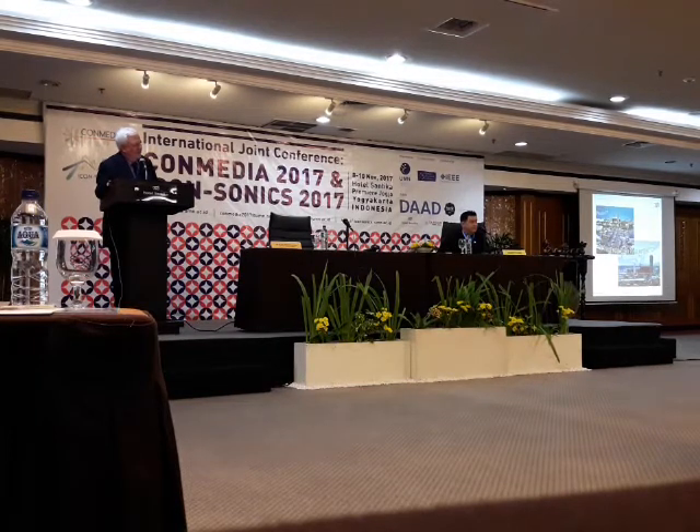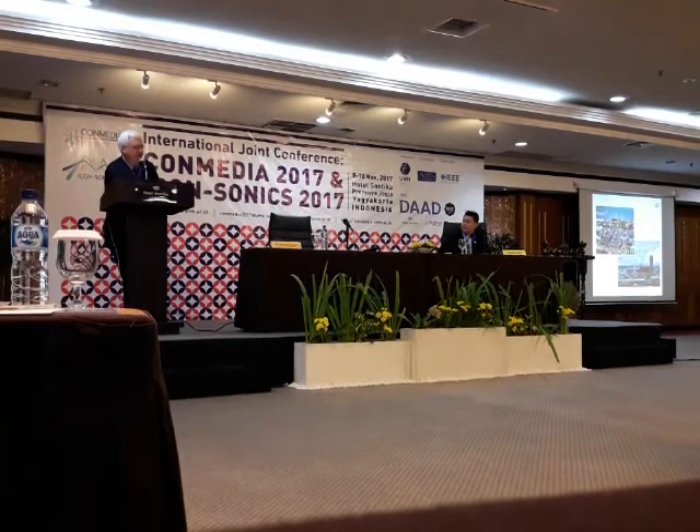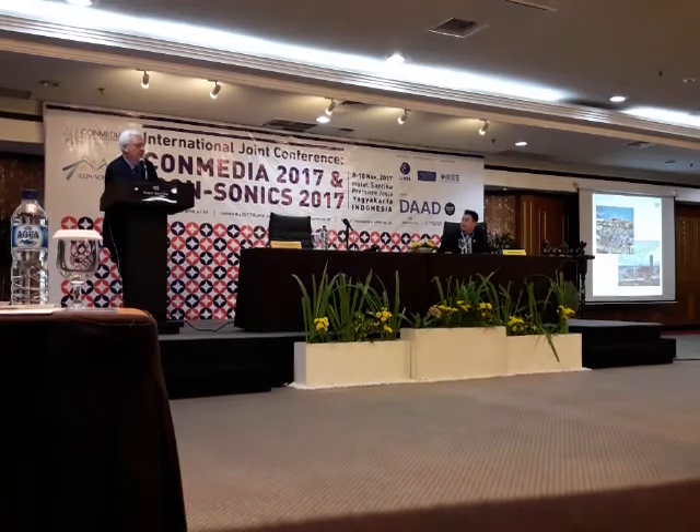Will you compare mechanical versus photovoltaic? Photovoltaic is completely different because the energy density of photovoltaic cells is much higher than that of mechanical energy harvesters. Unfortunately, photovoltaic cells will not operate when it is dark. So you can collect energy during the day when it's bright, store it into a storage element, and then use this energy when it's dark. Nevertheless, in some cases you never have light, and under these conditions it's better to have a mechanical energy harvester as well.